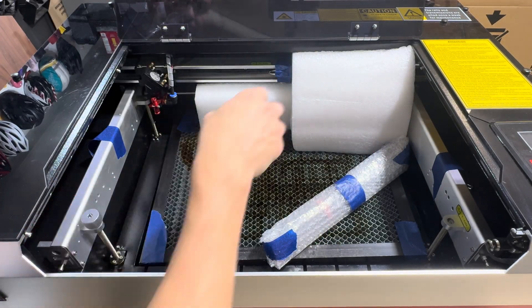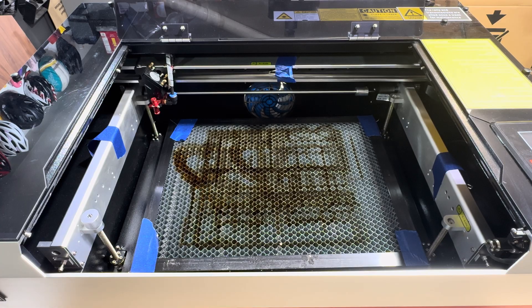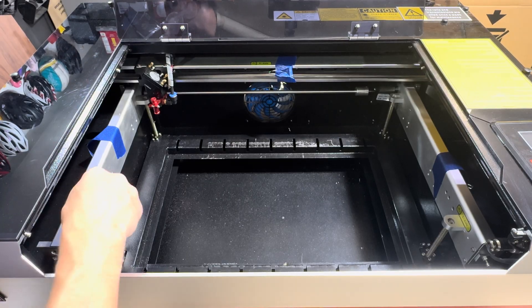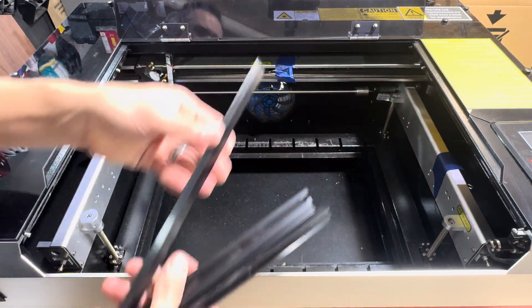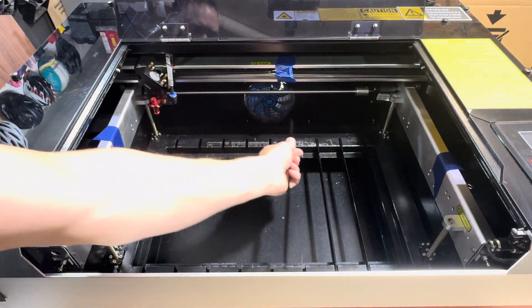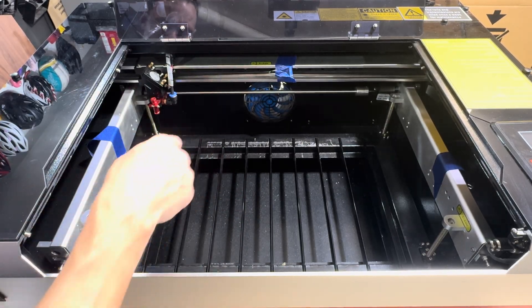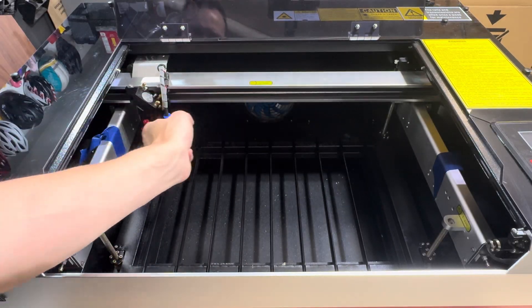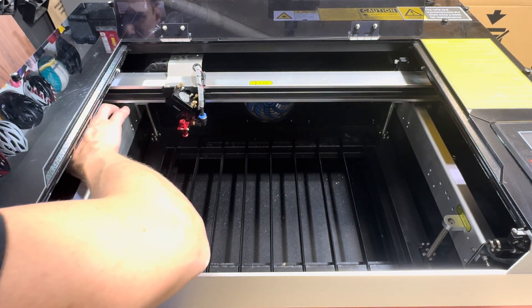Taking the rest of the packing out, you'll notice little pieces of blue tape all over. The blue tape is where they've put clips on the rubber belts to keep the bed from moving back and forth during shipping — you'll take all those off. Here I'm putting in the laser knives. They look brand new, and I like to have the knives in and then put the honeycomb bed over the top for extra support so it doesn't sag. Those clips are on the belts, one on each side.